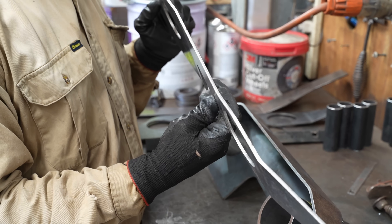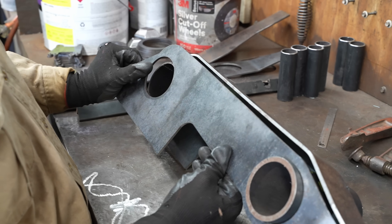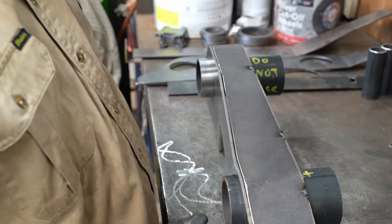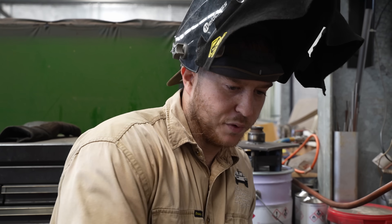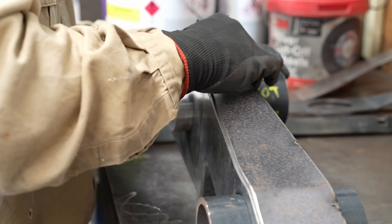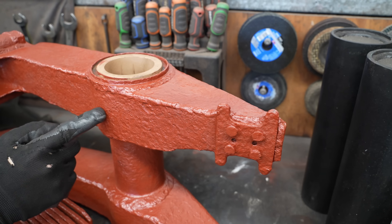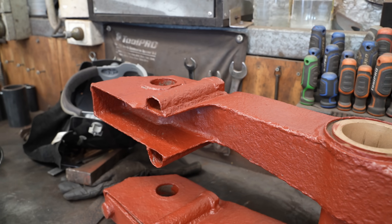It's a little bit of a nightmare the way it kind of works. So this just goes on and locates. So is this exactly how the other ones were made? The original ones were fabricated like this, but they would have had a jig. Because we've only got to make two wheel stations up, it's not really worth spending the time making a big massive jig. So this is just a temporary holder just to bring it all together. So this piece starts there, comes there, bends down, goes around, goes on the inside, bends up, goes around the pipe and then finishes through on the end.